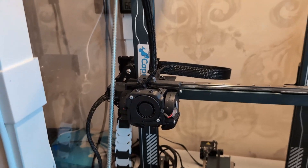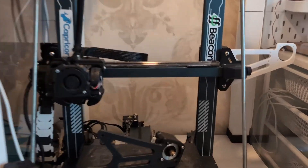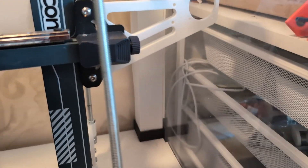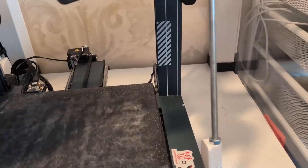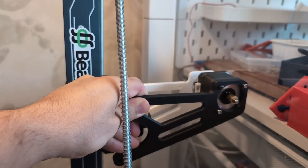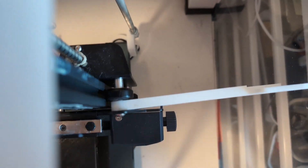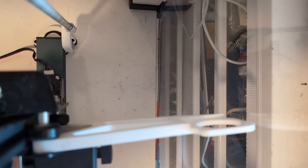The first part of the build and CAD process was figuring out how I'm going to mount the motors. My idea was to try and piggyback off of the mounts that are already on the X bar. It has two little screws with eight millimeter spacers on them, and I essentially designed the plastic slightly bigger so it perfectly slots over and uses both gaps — in front of the roller and behind it.